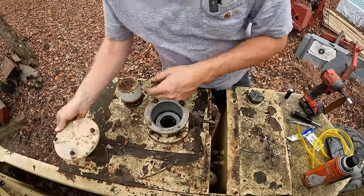Well, I had to hurry up and shut this thing down because somebody added this aftermarket oil pressure line here, and the plastic hose that feeds it, which is pressurized, has a big rupture in it right there. So it was dumping engine oil inside of there, and I couldn't really tell until it started flowing out the side of the machine here.